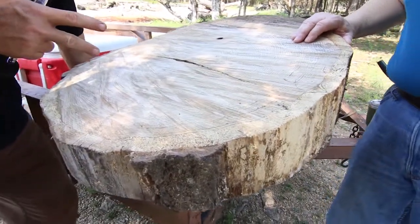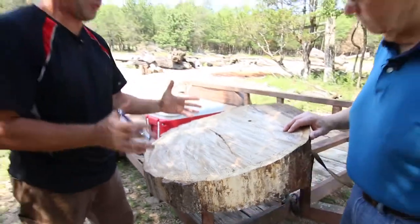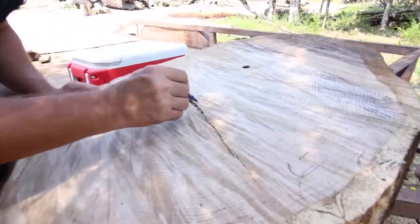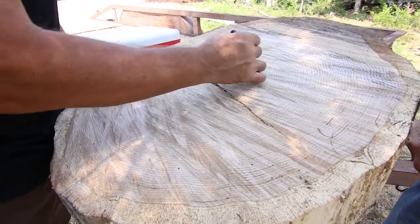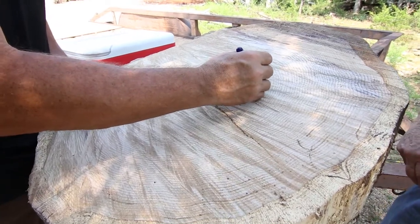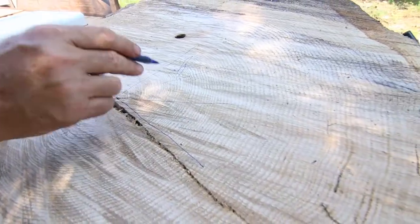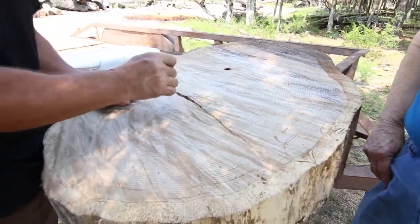And so as I look at this, I wanna think about the three different types of cuts that I can get from this particular wood. Everyone's familiar with the terms flat sawn, quarter sawn, and rift sawn, but really we can see in this what that's gonna mean. So as we look at this, we wanna think of literally a right angle triangle or something at 90 degrees here. We know that anything that's at 90 degrees to the vertical is something that's gonna be considered quarter sawn. And then we're gonna go through that 90 degrees at about 30 degree increments and talk about our different cuts. So everything that would be in this pattern right here would be considered quarter sawn wood. Because again, the rays are anywhere between 90 to 60 degrees of that vertical piece.